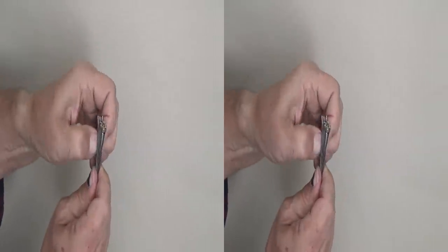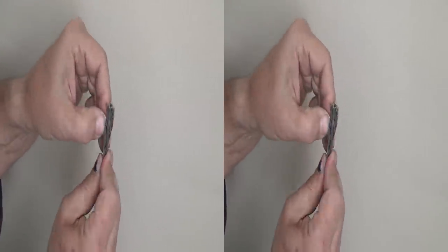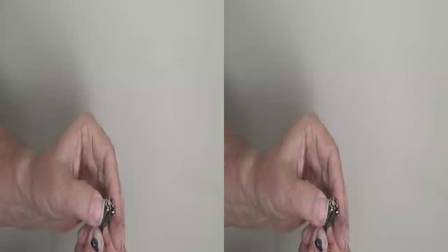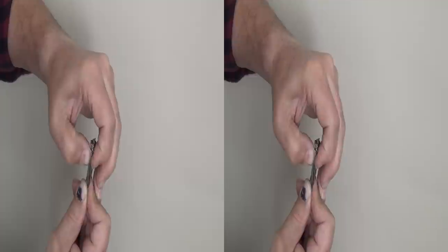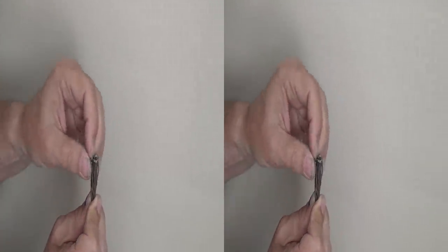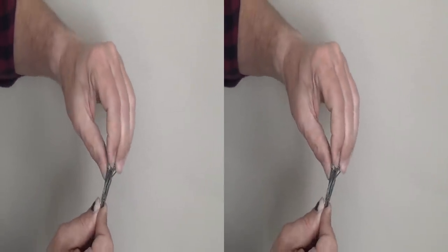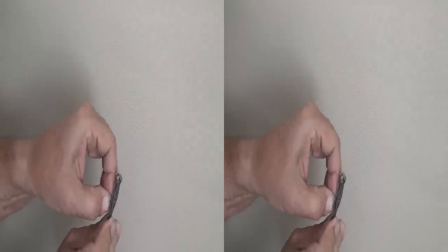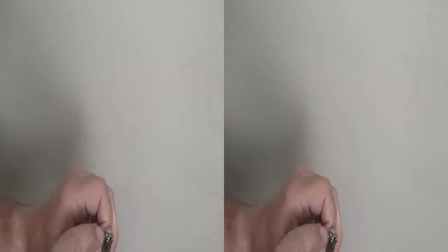Then you're going to relay these wires back in the order they were taken off. In my case I'm placing two wires per indent on the side of the cone. Getting the proper wires in the proper place is also kind of hard to do — you can't have them overlapping. Sometimes you need a little jeweler's screwdriver to go in there and pull out the proper wire from the one next to it, because they like to wrap around each other and get close.